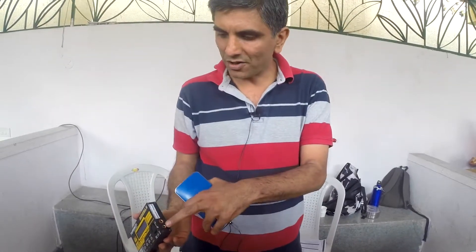That's a battery indicator. These are lithium polymer batteries with an external charger — you just connect that to these cables and it charges. This is a 280 watt motor, which is about one-third HP. On a full charge, the battery pack will run for about one hour, and it takes about 30 minutes to fully charge.